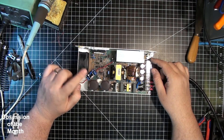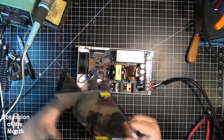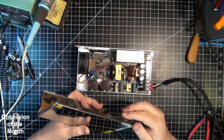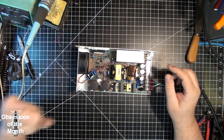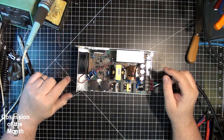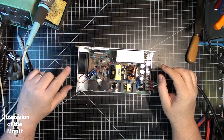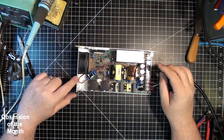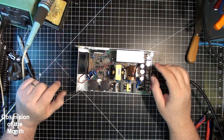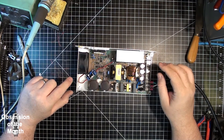This thing can go as high as 14 volts and as low as — you can go lower than 10. This is one of the most adjustable power supplies I've seen; most of them you can only adjust three to five percent. This one I was able to adjust all the way down to 10 volts — I stopped there even though the pot seemed like it would go further — and when I adjusted it up it only went up to 14 volts.